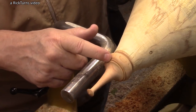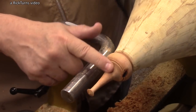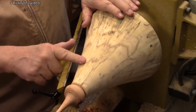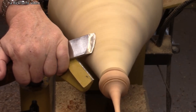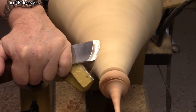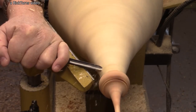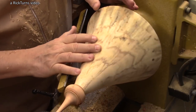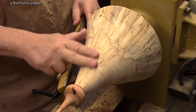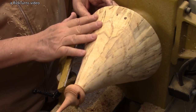It's pretty clean — got a little chipping there trying to get that sharp edge, but I've got to sand it anyway. I think that's all the decoration I'm going to do on this piece. Now it's back to the main body. I need to take that down a little bit more, smooth up the rest of this if I can. Now I'm going to use a shear scrape using a scraper to smooth it out — I've got some torn grain right here to deal with.